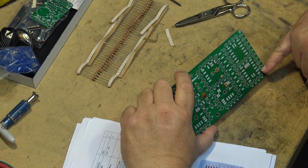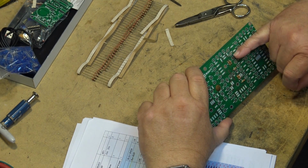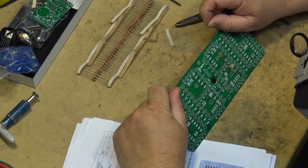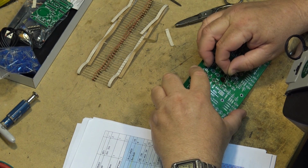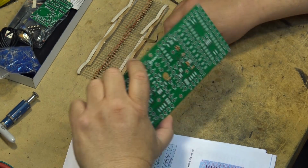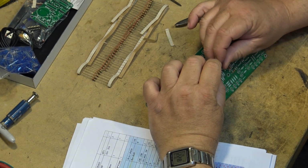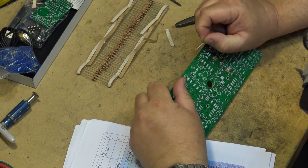These have typically been resistors where there's no writing in the box. It has the writing beside it just to differentiate them. So there's RE, RC, RG, RF, RB, RA. I'm looking for RD, and there's one other one. There's two others. There's RDP. And there should be an R. There's one more to go in here. Where the heck is it? RD, right there. So these are the 8 330s. Get mounted on here.